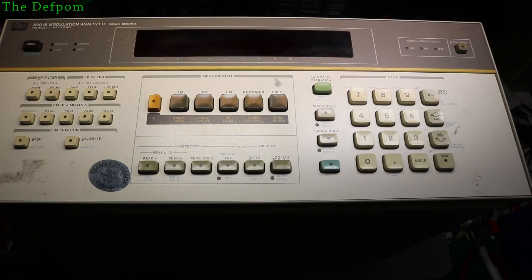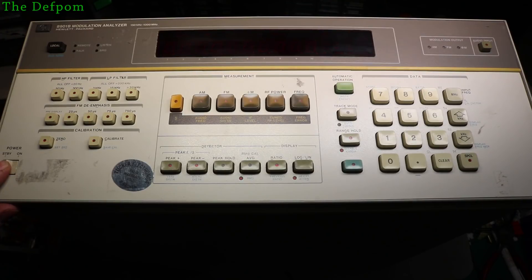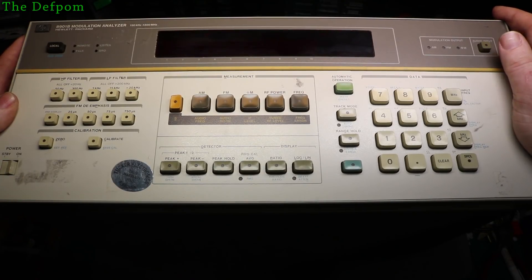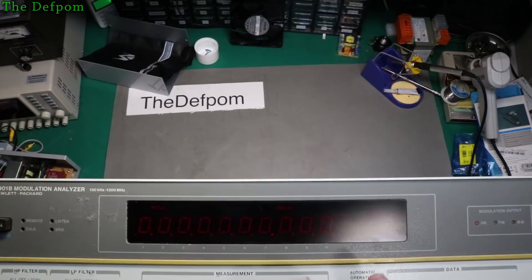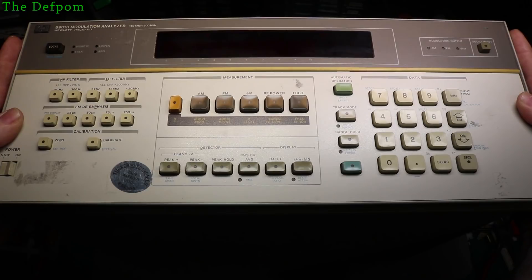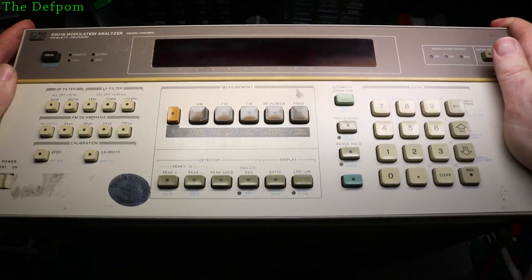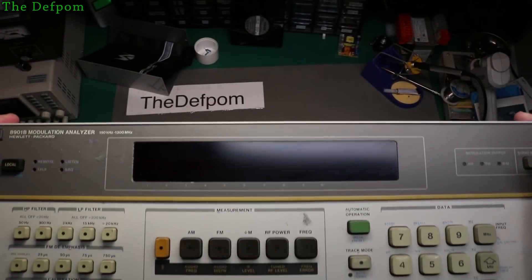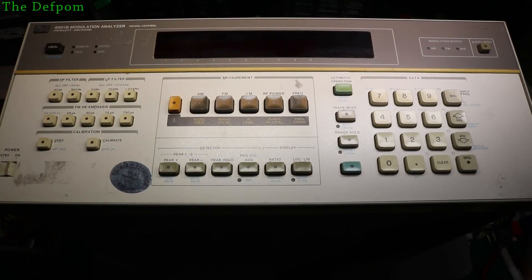Let's power the thing up and see what happens. Ready for the bang? Oh — that sounds like a shorted transformer almost, or something shorting out. That's why the display is flickering. All the indicators are on. She ain't happy — looks like a power supply fault. So at least we know what to deal with. This project I'll put to one side with the queue of projects, and at some point in a future video I will pull this thing apart and investigate. It sounds like the caps are gone — no smoothing, so AC is coming straight through. That'll play havoc with digital circuitry.